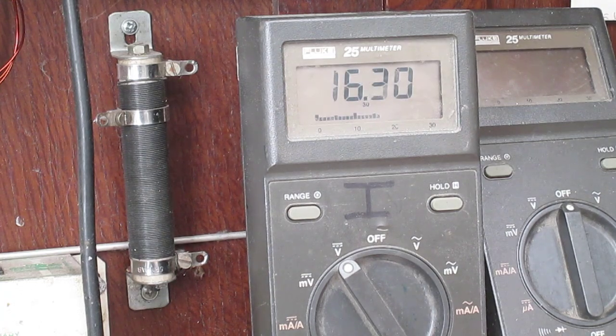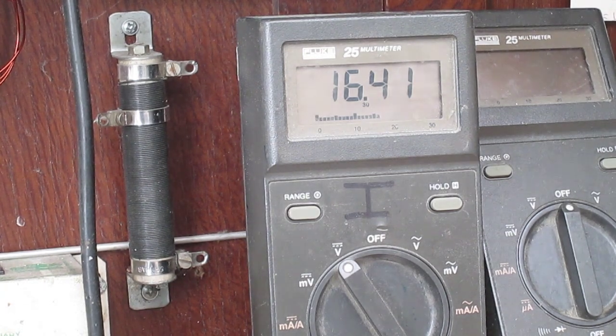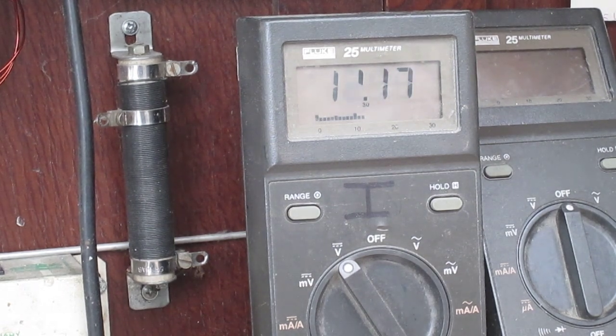And this is the low voltage supply reading straight off the cap. Obviously it's not going through any series pass. Sorry, I'm still reeling from that big bang. Not going through any series pass transistors at the moment, and obviously both of them have got no load. The capacitor is rather beefy, 10,000 mic, which is more than adequate to supply 1.5 amps. So everything's working pretty much as expected, apart from foolish people going in and shorting things.